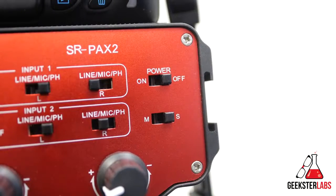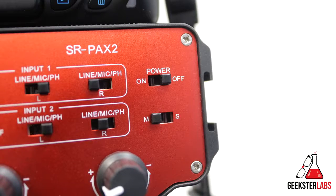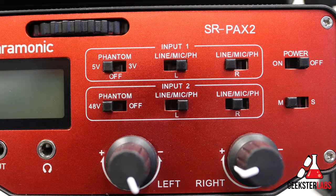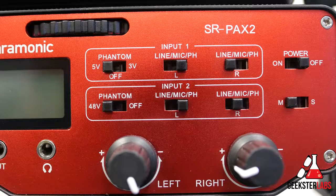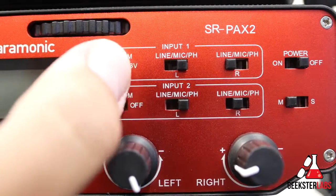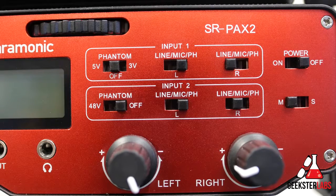On the right we have the power on/off switch and below that the mono/stereo switch. If you're only using one input channel you'll want to keep it in mono, which splits the signal to left and right channels. Input 1 is for the 3.5mm input on the front, and input 2 is for the XLR inputs. Both settings are similar except for phantom power voltage: input 1 has a switch for 5V and 3V phantom power or off, while input 2 has a switch for 48V phantom power. The left and right settings each offer three options — line, mic, and phantom power. Line and mic are basically the same except mic offers a 20 decibel gain, which you'd use for a self-powered microphone or wireless mic system. Line is set to 0 decibels for audio devices like an MP3 player. To use phantom power you set the channel to pH, but be careful — using phantom power on mics that don't support it may damage them.